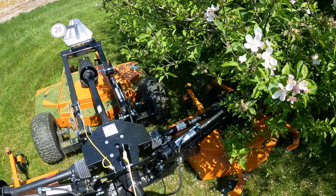Okay, we're coming up on one of these gullies on the left-hand side. I want you to watch that left mower deck. Look right there. Those front gauge wheels momentarily dug in and lifted up the backside of the deck. You can see that's a pretty big gully there, but I did have it happen a couple of times going around the pond. Not a big deal, just something I need to watch. I need to make sure that I don't get those gauge wheels in too deep of a hole, such that they put too much strain on the rest of the deck.